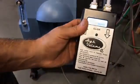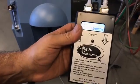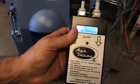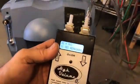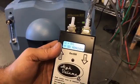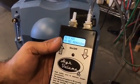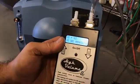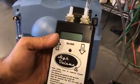Mark, why might somebody want to test oxygen purity? Well, if you're working and your torch flame starts acting funny, chances are one of the concentrators in your bank has got an issue. The only way to find out is to test every one of them. We're going to show you two ways to test today — with the oxygen purity tester, and also using your Centerfire.